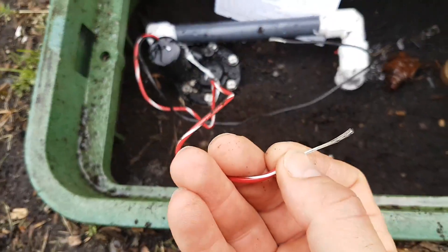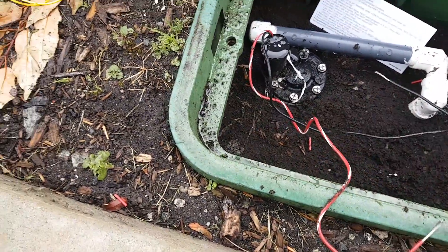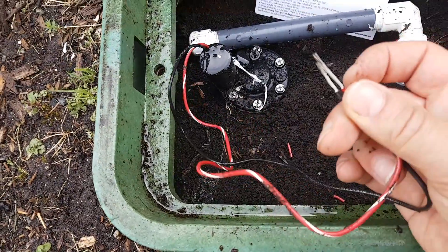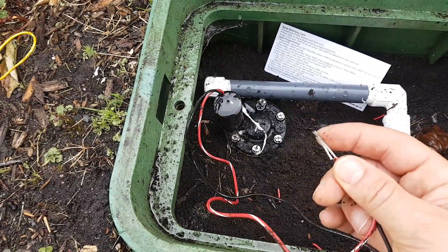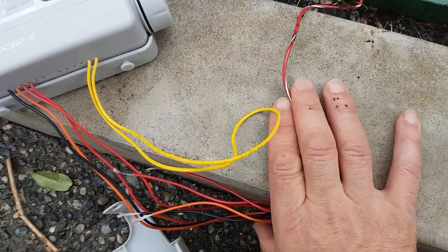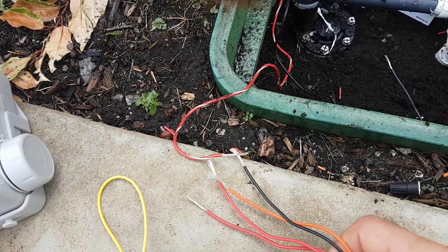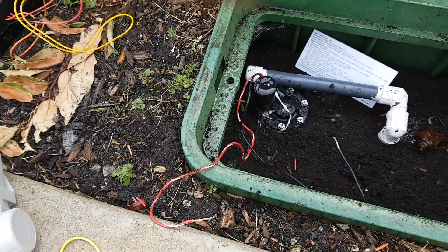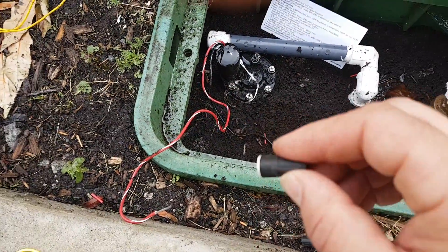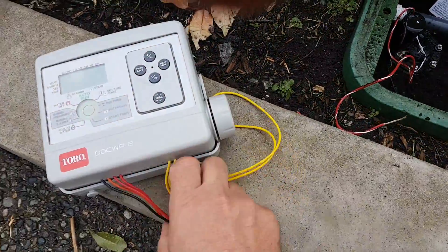I always like to take some extra wire off. The manufacturer says you can just hold the two wires together and twist a wire nut onto them, but that's not ideal. You actually need to twist the wires together first. The reason I like to do that is because if the wire nut ever comes off, the wires will still be attached together. If you just hold them sideways and turn the wire nut on, someone will come into the box, move the wires apart, and if they're not on tight they just fall off — and next thing you know your plants are dead.